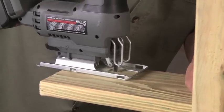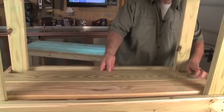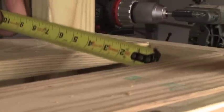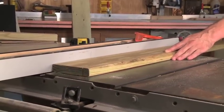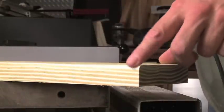Use a jigsaw to cut out the scrap and fit the boards into place. The last board is the center piece — just measure the distance between the two outside boards and rip a five quarter inch board to width. Soften the cut edge of the board with a round over bit or sander to match the other edges.